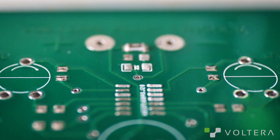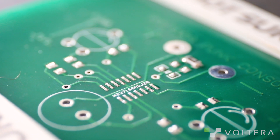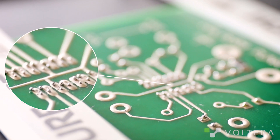For the same material science reasons, there's one thing that you straight up can't do with a board printed using conductive ink: reflow a bare board. You can do this with an etched copper board, but if you try it with an additively printed board, the solder paste will ball up, and you're going to have a bad time. The fix is easy — you've got to populate your board when the paste is wet, and then reflow, not the other way around.